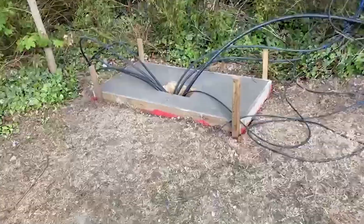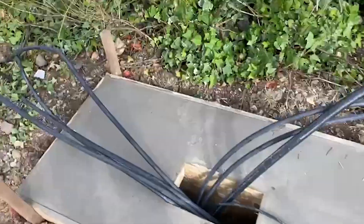It's called dynamic power sharing. Because they're all linked, if you plug one in you'll get 22kW, another 22kW, another 22kW — but eventually it'll hit the limit and reduce them all, so it'll never trip the breaker or set fire to the cable.